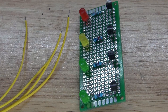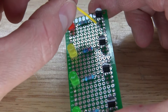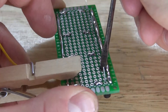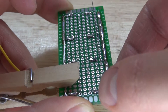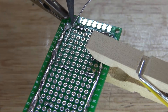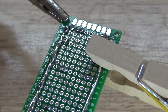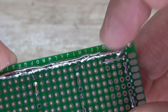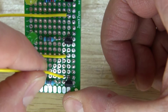Next I'm going to take these four wires and connect them to the circuit — these will be my electrodes. I'm going to connect them to the base of each transistor. Bend over the wire and bend the base of the transistor onto the wire, then solder it into place and solder bridge it to the wire. Repeat the same process three more times.